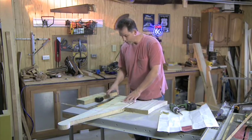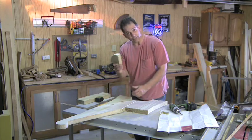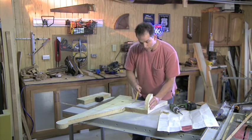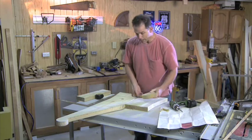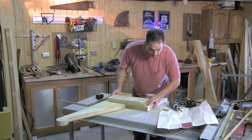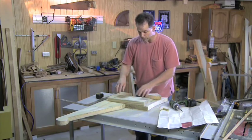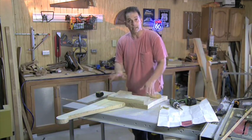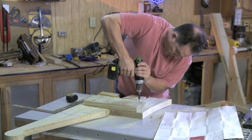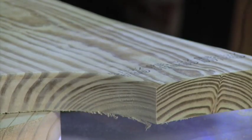To join our two pieces together, we're going to use a two-by-six cleat. To get the width of that cleat, we put our two pieces together and use that scrap piece of wood to measure in from each outside edge and make marks. The distance between those two marks will be the length of the cleat. We'll align it against the top of the shorter piece, drill some pilot holes, put screws in, and this one side is just about complete. Once the end is complete, use a round-over bit to soften the semi-circle formed at the bottom — this gives the bench a real finished look.